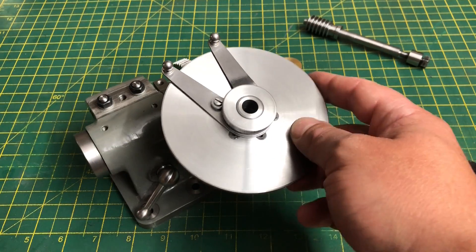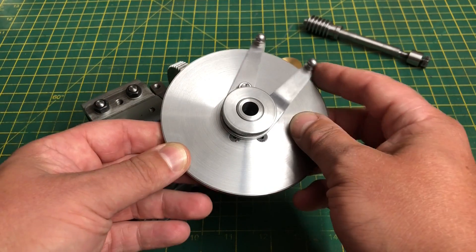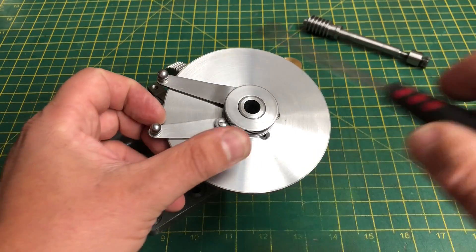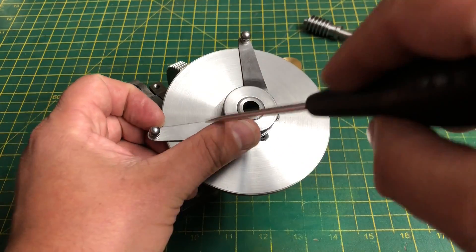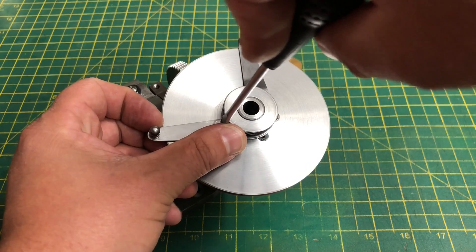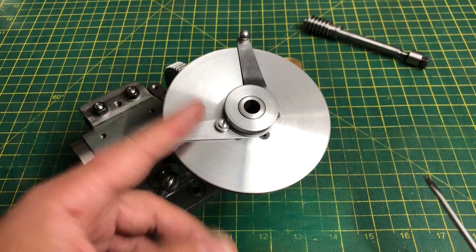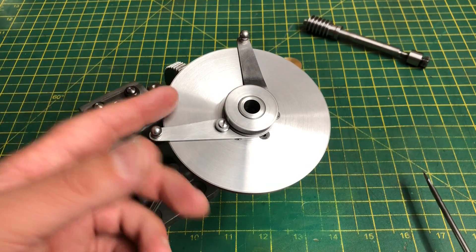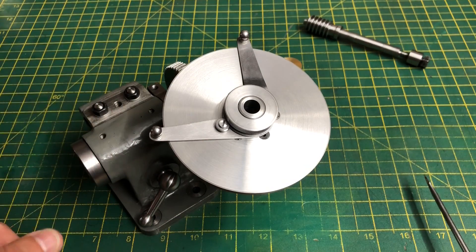Well these are the parts I was looking forward to the least and I am reasonably satisfied with all of it. The fingers move nicely around the plate with no interference from the spring and the clamping arrangement works positively without undue force. In my haste I have made the screw from mild steel which is not ideal for a screw head - Thomas suggests case hardening in the book but I've never had great results with that. If the screw begins to wear unacceptably in the future I'll remake it in silver steel and through harden it.